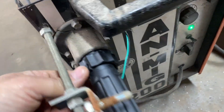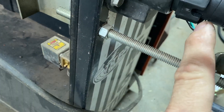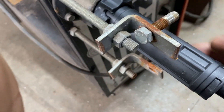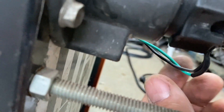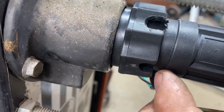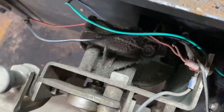I made one mistake — I tried putting an extra notch into the lock collar, but that was wrong. I actually had to put a notch into this longer piece, because with this notch and the wires coming through there, I couldn't spin the lock collar. So you can see I have the wires just far enough back to clear the collar — I brought the notch farther back into this piece. Then I just ran the wires through the hole I made earlier with the grommet and ran them inside.